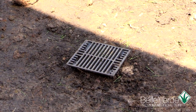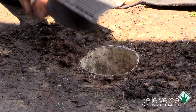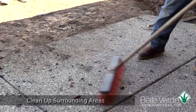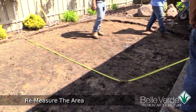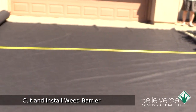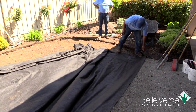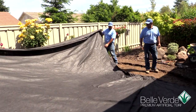If drains exist, you'll want to make sure that the head rests below the fabric layer of your project. Simply trim off part of the pipe and return the vented cap. Clean up after the site prep to remove organic materials from concrete and any loose bark or other elements that interfere with installation. Re-measure the width and depth of the prepped area. This can help you determine how much weed barrier fabric to cut and install as well. Roll out, measure, and cut construction-grade weed barrier fabric. Bring it into the project site, spread and stretch it over the project area, providing 4 to 6 inches of overlap on seams and outside of the area where you're going to be installing your base materials.